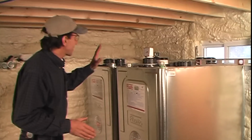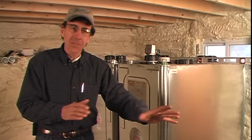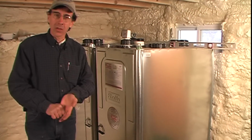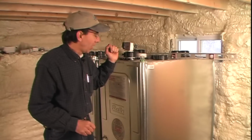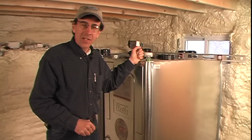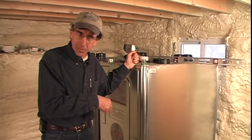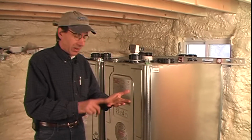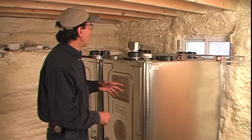These tanks cost more than a steel oil tank, I'll be right up front with you. But when you do an installation like this, consider all the reasons I just gave you: the dual containment, and there's a $1 million insurance policy on the tanks against accidental spill, a cleanup policy. They'll insure up to $1 million worth of cleanup if there was ever a spill from these tanks. That's how sure they are about them. So you've got that, you've got the fact you're not going to get sludge, you've got a small footprint.